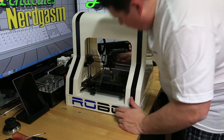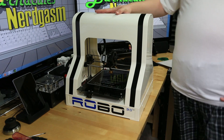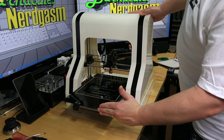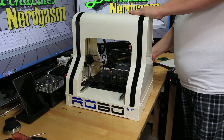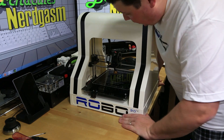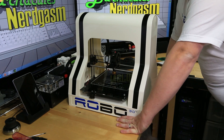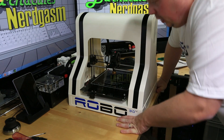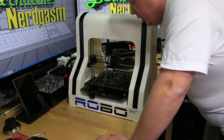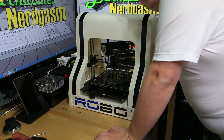The print head moves up and down using worm drives — each one connected to a stepper motor from both sides — and it moves back and forth with a belt. It's a really unique design. The first thing I'll notice is it does have a pretty big footprint compared to the Ultimaker because you need clearance for it to come out about four or five inches on both sides. The wiring looks clean, and if speed isn't a huge concern, something like this should be a good alternative because you save a lot of money going this route.